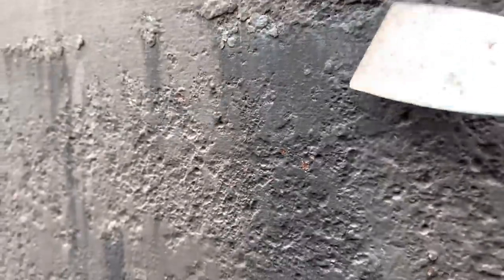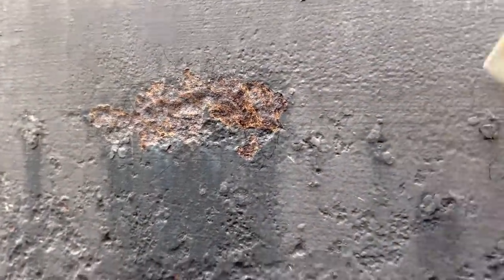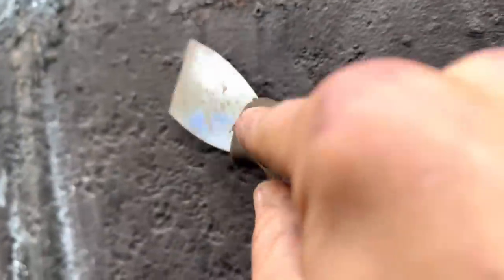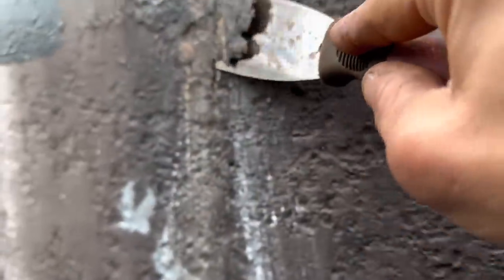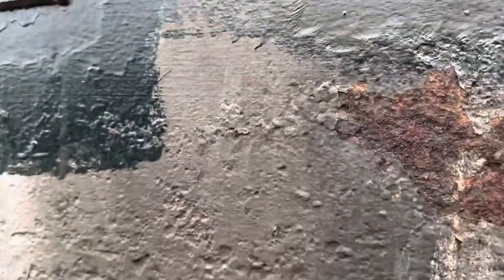Waterline needs a bit of work doing to it. So, where was that? Here we go. That stuff there can just come off, grind that back a bit, treat it, and then put some blacking back on top. But this is all the way along, all this stuff. This is just waterline damage. It's everywhere, but that's not hard to take off, to be honest. Look at it, there we go. That was obviously underneath the old skin fitting, which may not have helped.